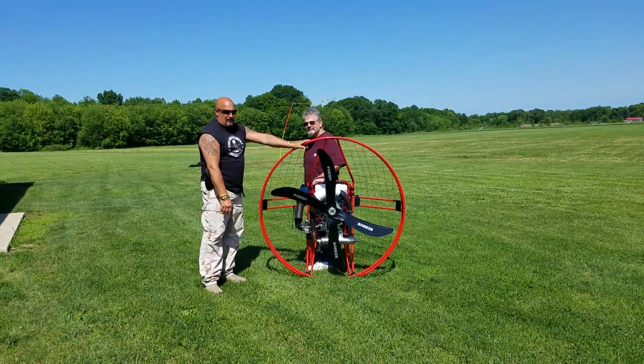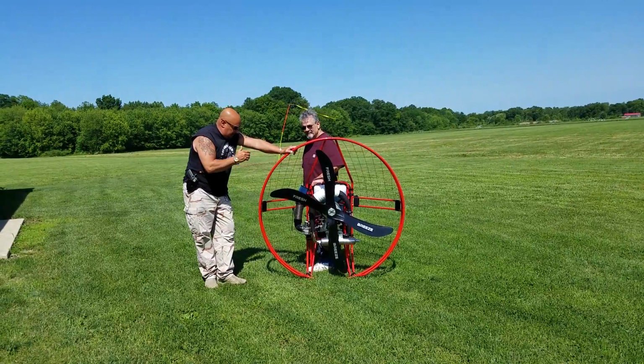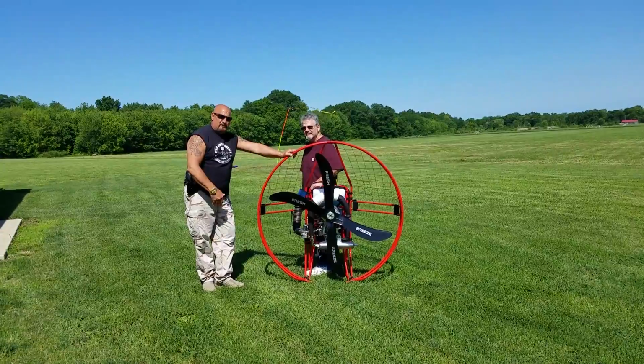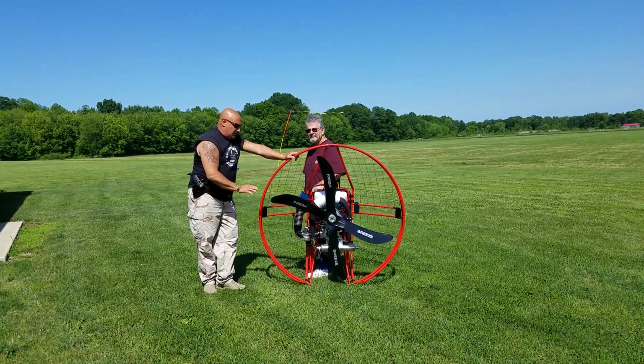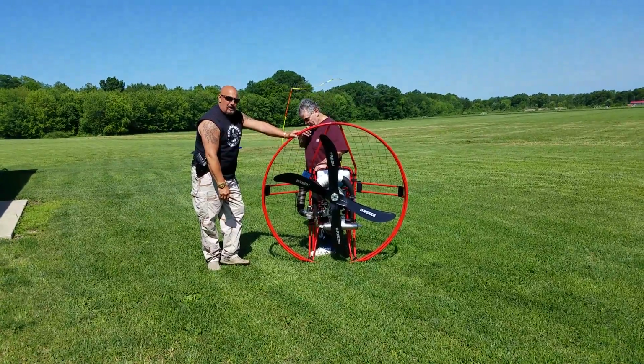If you are worried about it, then yes, take your spark plug cap off. But I think it's better just to drain them out when you're done, or if you're going to have it somewhere where you're away from your machine and somebody might be tempted to spin that prop. These start so easily. They're amazing, and that's what we like about them, the dependability of them.